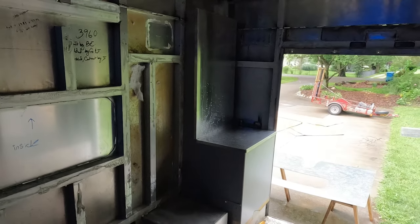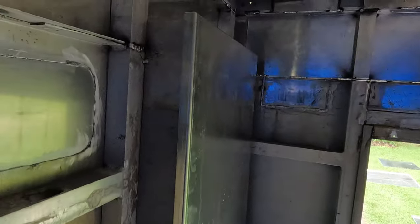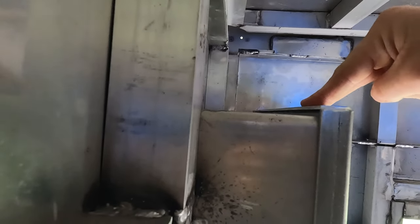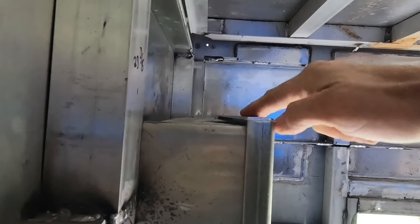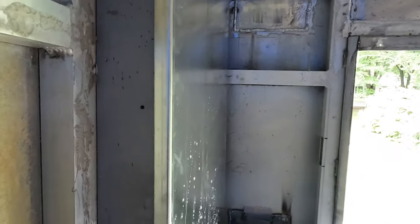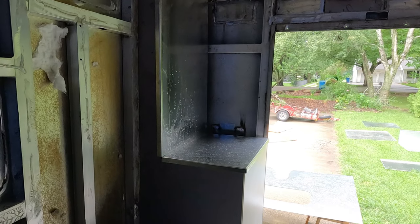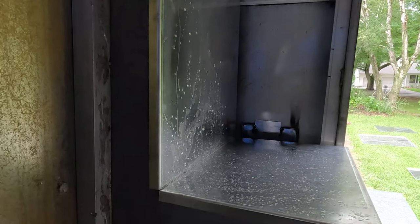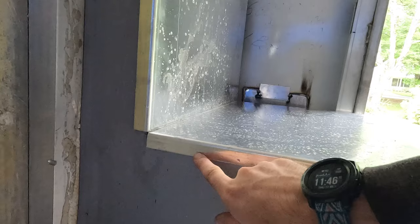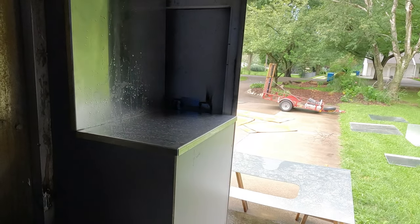Cabinet number one. If you didn't see how we measured this, we have one-inch flanges. You can see it's a little bit too tall, but that's not a big deal — we'll be riveting this on. I didn't want to weld all of these cabinets, it'd get very messy. So this is our fold method — we just brought it to a sheet metal company locally, and we'll drill through here and rivet every four inches. That'll create a nice watertight seal.